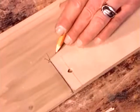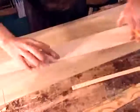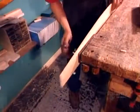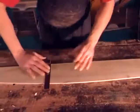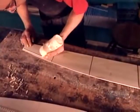The instrument maker traces a rib-shaped template on the wood, then cuts out the shape using a bandsaw. He clamps them onto his work table, then with a plane makes them symmetrical. He draws three lines across each rib to mark where he'll cut slots — you'll see what those slots are for later on.